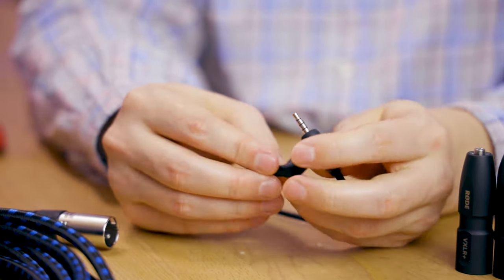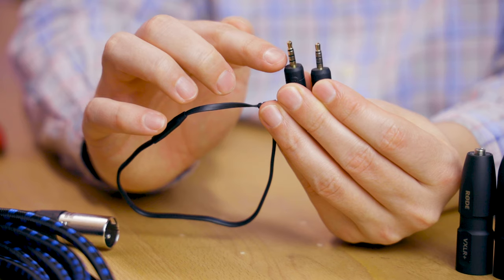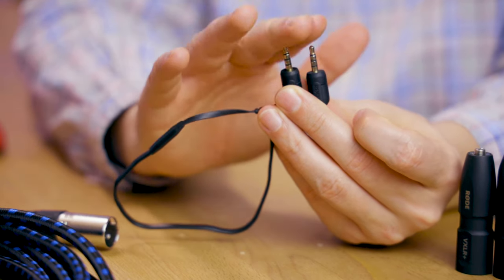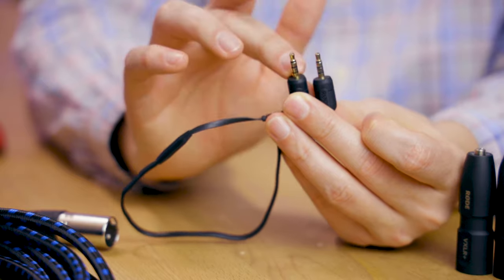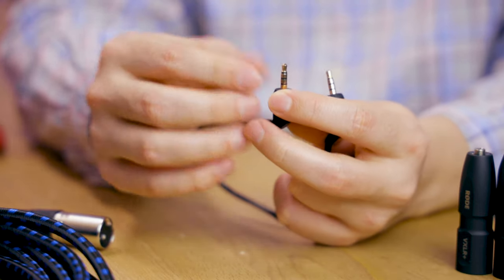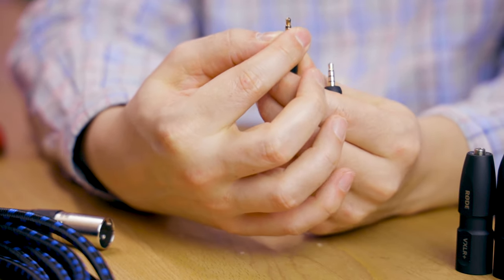I'm trying to convey this as best I can and may have some errors, but I think I have the general concept down. For example, if you have a cable like this — in this case, the connection has four metal rings on each side. This is a TRRS cable used to connect stereo audio and microphone at the same time. Now if you have an unbalanced signal, that always just needs two connections for a mono unbalanced signal — so imagine you only have the top two wires: one ground and one that has electricity on it.